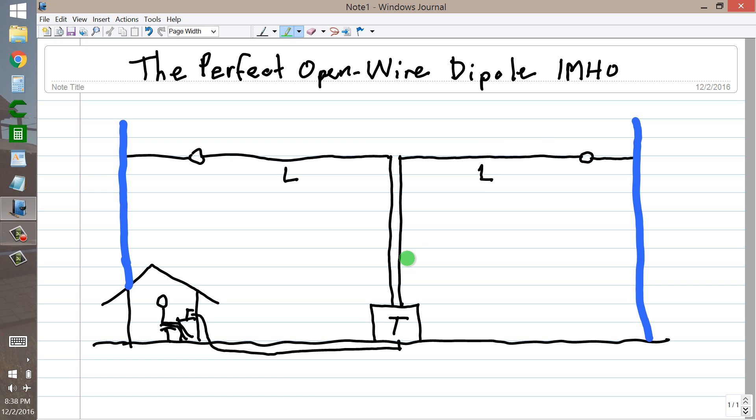It served as a backup antenna. It was simply an open-wire dipole with a transmatch — 6-inch spaced open-wire line running perfectly straight off, up to a symmetrical dipole antenna roughly cut for something between 40 and 80 meters. It was somewhere along that line, 66 to 132 feet. I'm not sure exactly how long it was, but it was about that far.